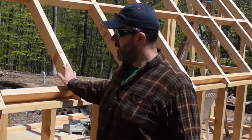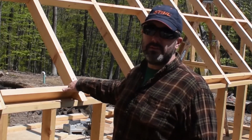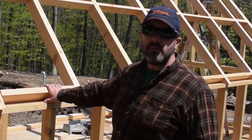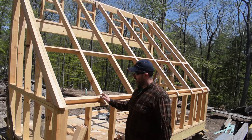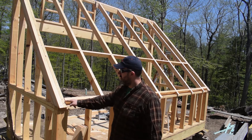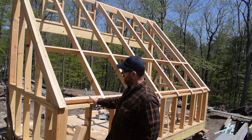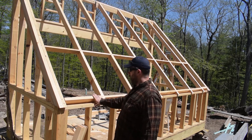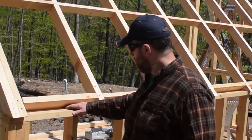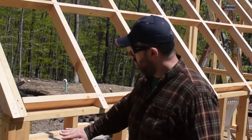These strips are what the roofing screws into and through into the roof itself. So these strips need something to attach to, and that's the purpose of these — plus for stability and support for the roof. I measured three and a quarter inches up on each of the rafters, then measured across the distance needed to cut the pieces that go in between. The lower part is going to be sealed off right in here, so the roof will attach here and hang down over this.